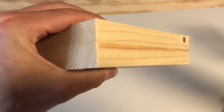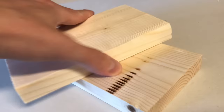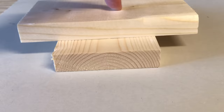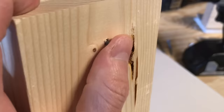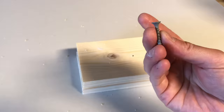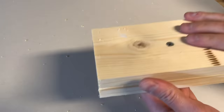When you're pinning two boards together through the cross grain — like this, or like this — you really want one to one and a half inches of screw thread going into the bottom piece. But sometimes this is too much screw because the bottom piece is only three-quarter thickness. So if you have two of these pieces lying flat and you send a one and five-eighths screw through it, it's just going to punch through the back. In these cases, it's best to reduce to a one and a quarter and make sure it's fully embedded with a slight countersink — that's about the most grip you're going to get without punching through. If you feel unsure about the connection, just add more screws. Put in as long a screw as possible without punching through.